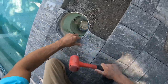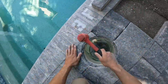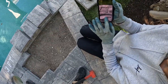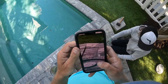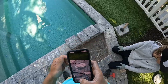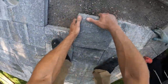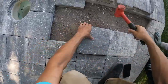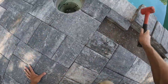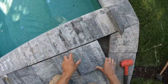Some of these skimmers can be a little tricky, especially if they have a grout lip on the inside — a custom little grout lip — you have to put it in there perfectly for it to fit. There was a hose laying along the walkway in the picture I took, so it made it difficult to see what pavers were in this corner. We just started working from the opposite way back towards it and finally figured it out. But man, these pavers were tight — there were a lot of areas that were real tight. We had to shave some stuff off on the side. Whoever laid it originally did a good job. That's for sure.